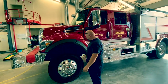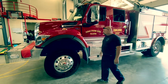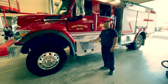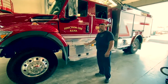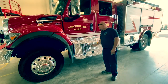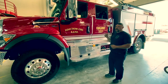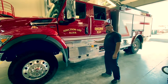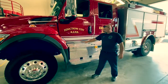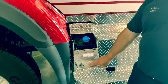This is a four-wheel drive vehicle, therefore it does sit a little bit higher than average. You'll notice there are two sets of steps on here. When you get out of this rig initially, be thinking about it — from here down to the ground is about three feet, so make sure you hit this step. Three points of contact on the rig at all times when possible. Make sure the brakes are set before you leave.